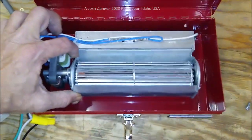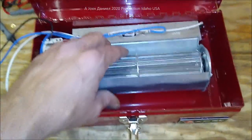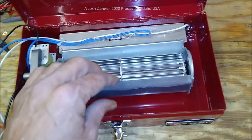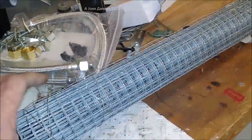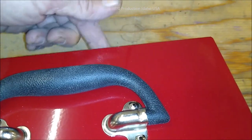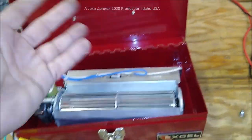If I'm looking down on it, I'll center it and slide it forward until it touches exactly where I'm going to cut. I don't need it to shoot through — just back enough where you can put a playing card in there, almost protruding through. Then you'll use something like standard woven wire, hardware cloth, that'll go across the front. A nice little wood trim attached, recessed about a quarter to a half inch depending on your paneling. The unit pushes air out so well it won't even get warm around the surface, but if you put shoes in front of it they'll get warm quick.